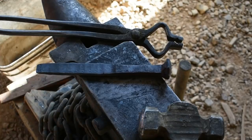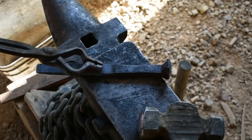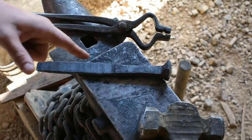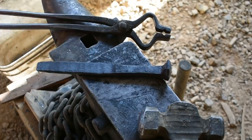We'll let this cool down and then we're going to use the metal cutting bandsaw. We're going to cut two lines — try to keep it even. What we're wanting here is three claws, so we're going to cut a line close to the edge, move over about the same distance, cut another line, and that'll form the claw portion of our little mini garden claw. After that we'll twist the handle and bend in the claw part.